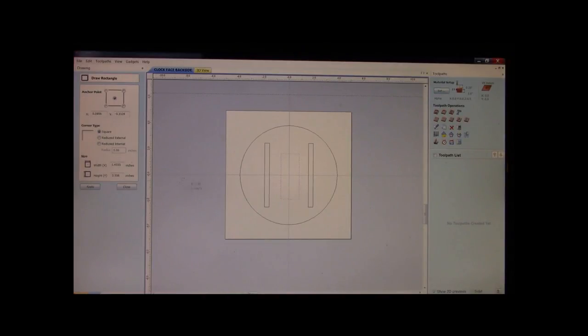Well, 3 7/8 is 3.875 for the height. Well, we're going to go a little titch bigger, okay? And our width was calling out for 2 1/8. So 2.125. Well, we're going to also make that a titch bigger, and we're going to make that 2.25. So 2 1/4 by 4 inches high.